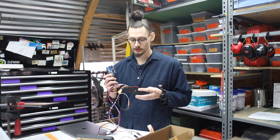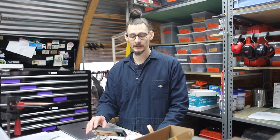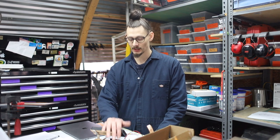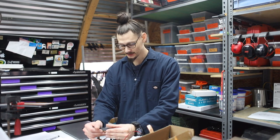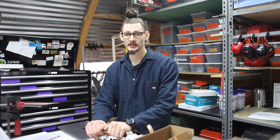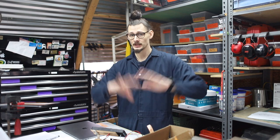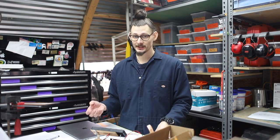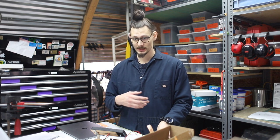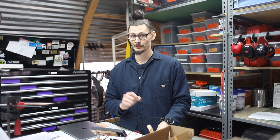This Arduino-controlled parking brake is still a couple episodes out. What we have made headway on is the CAN keypad itself. Now, this is a device that does exactly what it says it does. It sends and receives CAN messages. It does nothing more than that whatsoever. It comes with API documentation that allows you, as the end user, to program it in such a way to send and receive the CAN messages you want.